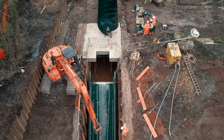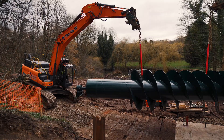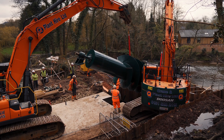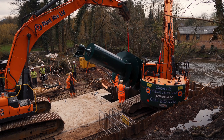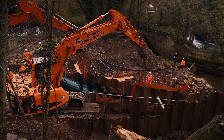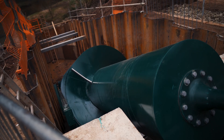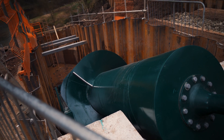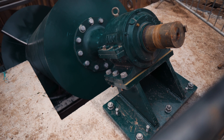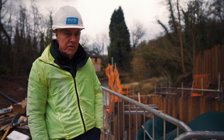After that had been done, it was loosely bolted down to make sure it didn't go anywhere, and then the Archimedes screw itself was lifted into position using the two excavators. The final part of the exercise was to get the bottom end of the screw aligned into its bearing hole, which was part of the trough structure, so that it slotted into the bearing hole. Finally, the top bearing — here on this slab at the top of the structure — was bolted down so that it carries the weight of the screw and prevents it from moving further down into the trough due to gravity.